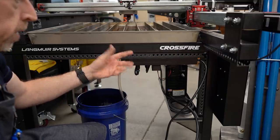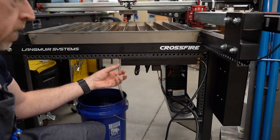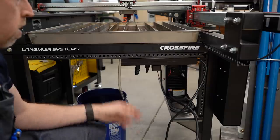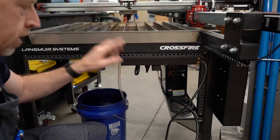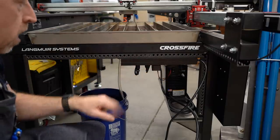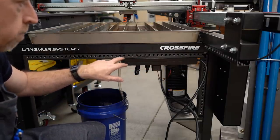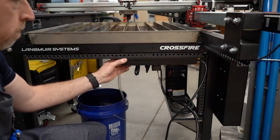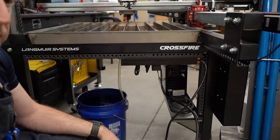I also could have just used a plastic plug strip, which actually would have been cheaper and more readily available. I had to special order the metal one because I wanted metal — metal is more better. But that actually bit me too, because I ended up connecting the ground to the table without thinking about it. Moving it to the plastic cover of the cable tray, I just put in four M3 screws with nuts and washers and nylon lock nuts so it won't vibrate loose. That solved that problem, and we should be completely isolated now.